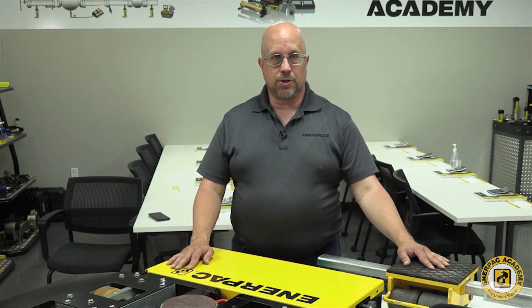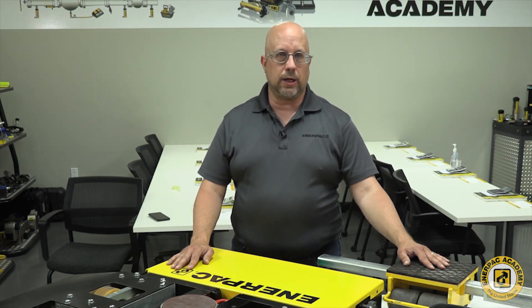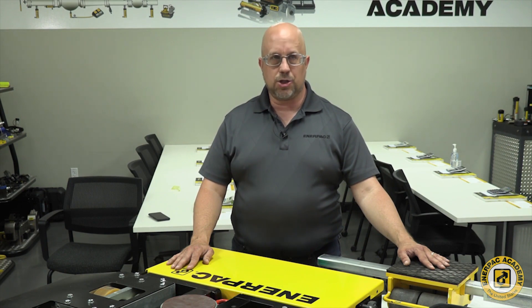Floor condition may be a big concern. In older facilities, the floor may be uneven or have cracks or other damage, so unless you are working in a new facility, the floor will rarely be perfect. Our guidance is that the E-Mover is designed for relatively smooth and level concrete or steel surfaces. The wheels can handle typical expansion gaps between concrete slabs up to about half an inch on the larger 50 ton unit. Wheel size is really the determining factor — the larger wheels of the 50 ton unit are going to be the most versatile.